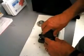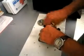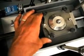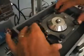The sand has been put in the shear box. Now we put the porous stone on top, and then the top of the piston. Then we move this to the instrument and drop the shear box into position. We make sure that the right-hand side of the shear box is up against the stop, and then we tighten the back end.